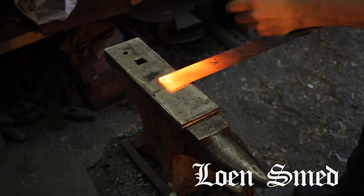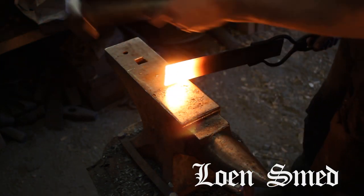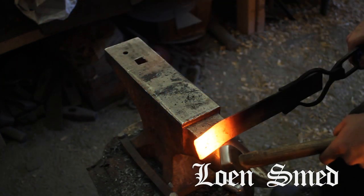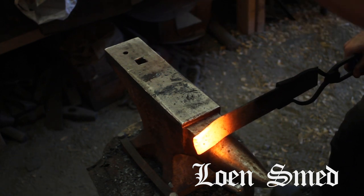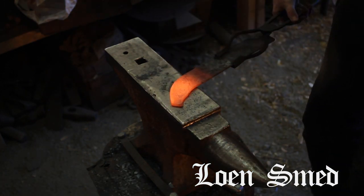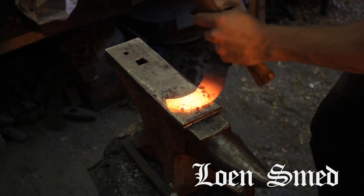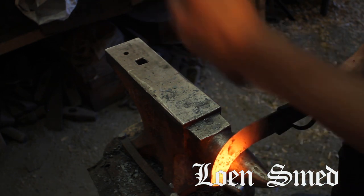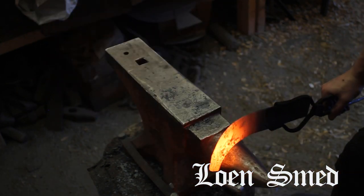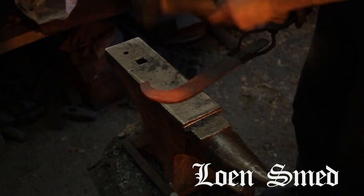After flattening, I move over to forging down the point and bending it over the horn to make the hook shape that the billhook has. As I'm doing that, I'm also overshooting the curve that the hook will have in the end, because as I forge down the edge of it, the curve will start to straighten out again. So you'll see me moving a little bit back and forth between the two, forging down the edge and then bending it back in again.